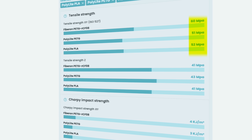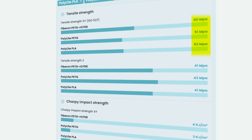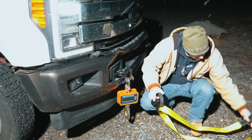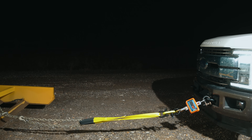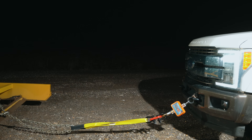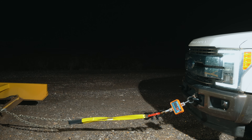Polymaker's chart shows exactly what should happen in a straight-line tensile test: PETG CF has the highest tensile strength, and PLA and PETG are just below it. But our test isn't a tensile bar — this toe ring sees a mix of tension, bending, compression, and shear, especially where the shackles squeeze the print. Under that kind of loading, stiffness matters more than ultimate tensile strength. As the load rises, PETG starts to stretch and deform long before it reaches its maximum strength, and once it starts to neck or creep, it can't carry increasing load anymore — which is why it failed early.